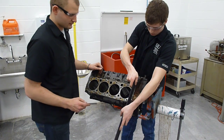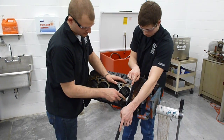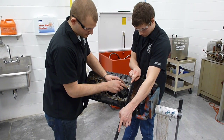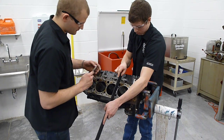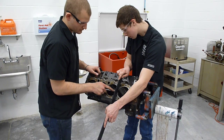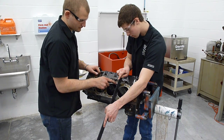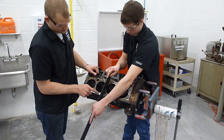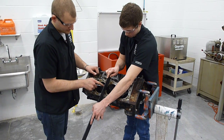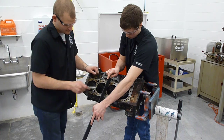You could look to see exactly how warped it is, but if you locate the feeler gauge that matches the warpage spec, you can use it as a go/no-go gauge. If it's warped three thousandths, it really doesn't matter — it's still in spec. So if you select the feeler gauge at the warpage spec, you know if it's go or no-go.